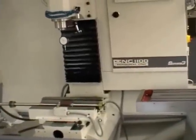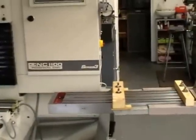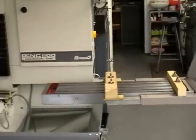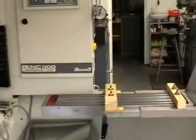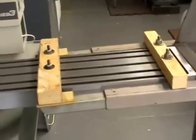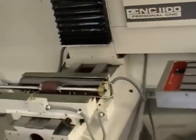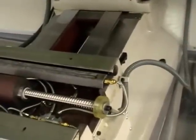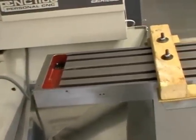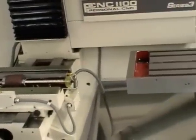The next stage of the process is to move the end of my enclosure and remove the table switch cams. Take the weight with some timber bolted across my die lifting trolley. First I removed the gib completely — removed the little coil line on the end and slid the gib out. Then took the weight with the table and carefully slid the table off, keeping it central so it didn't drag or scrape on anything.